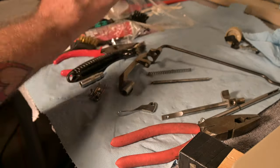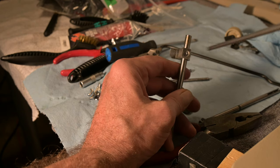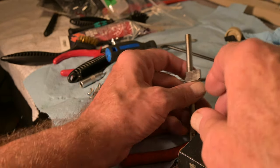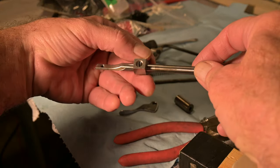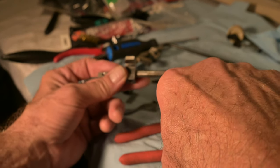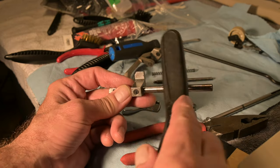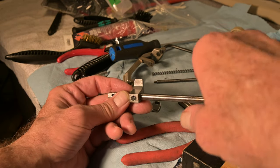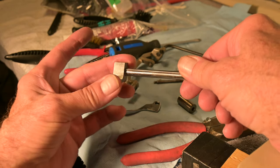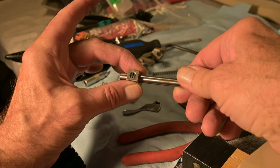What I want to talk about for a minute is what I'm noticing. When I put this piece on the presser bar, I'm just going to loosen this to show you what I'm talking about. When I slide the presser bar through there, it's nice and smooth. I draw your attention to that mark there and to the marks up here, because I have wire-brushed this with this brush. I didn't film it entirely but there are a couple of clips. So here's my point: when I try to take it out this way there's resistance, and even before I get there, right around here where you see some scratches, you can hear it and feel it.